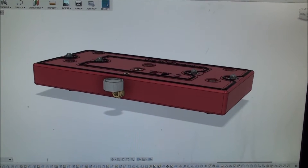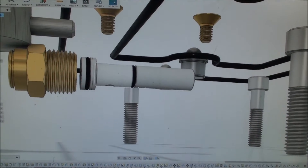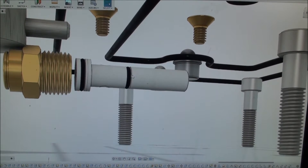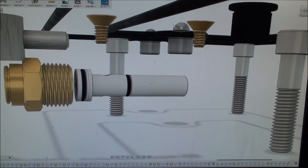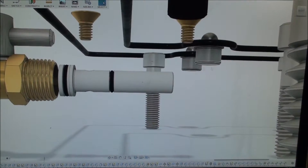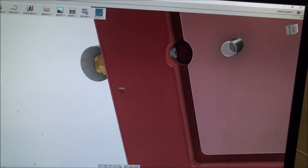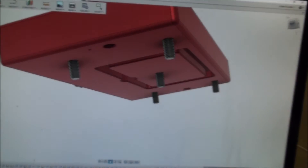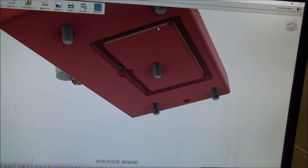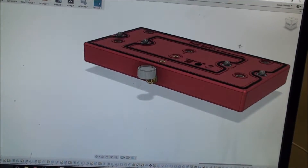If I get rid of this body here, on the inside you'll see that there is a vacuum generator in here. How this works is there's a hole here that runs along the top, comes to about right here, cuts down. This O-ring is sealed, this O-ring is sealed. When these screws are removed, depending on what sections of the pallet you're using, it will let vacuum come down, go through this Venturi vacuum generator and get exhausted through the back of the pump. The bottom of the pallet has an evacuation area that runs along and is exhausted down into the table so this area will be exposed to the T-slots in the table. Hopefully that will keep the noise down because it is going to move a little over 4 CFM through that pump to generate 28 inches of vacuum.